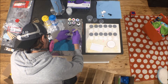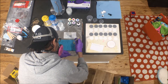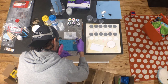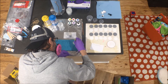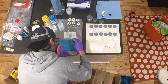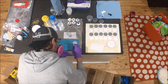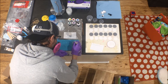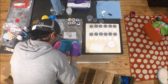The first thing I'm going to do is use the Cast Magic — you just lightly brush that right into your mold. I'm doing a test here using some Voltron Legendary Defender coins that I'm planning on making as a set, and I want them to look metallic. I'm not sure what's going to turn out better: the Cast Magic or just using the aluminum powder. I'm doing half the mold with the Cast Magic, just a light brushing, making sure you get everything nicely coated and not making too much of a mess — though you probably will.